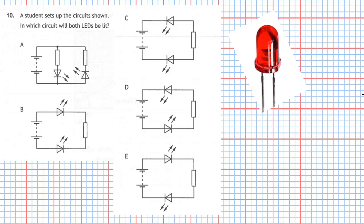Here is a real LED and here is its symbol. You can see two legs, and each leg must be connected in the proper way to the battery. The right-hand leg should be connected to the minus part of the battery, and the left-hand leg should be connected to the positive side of the battery for the LED to work properly, conduct, and give off light.